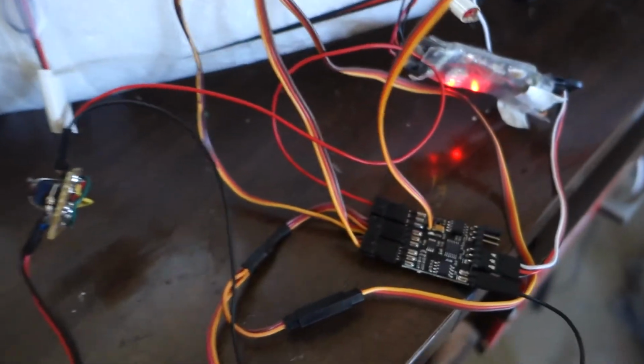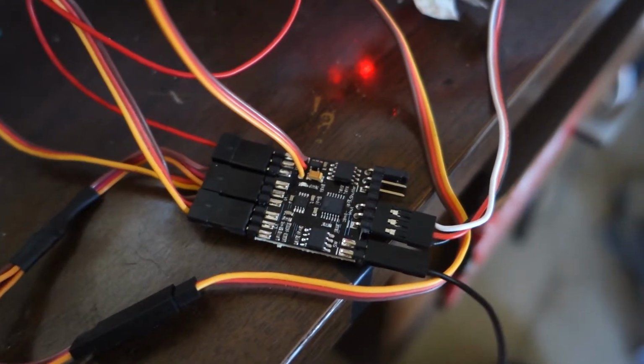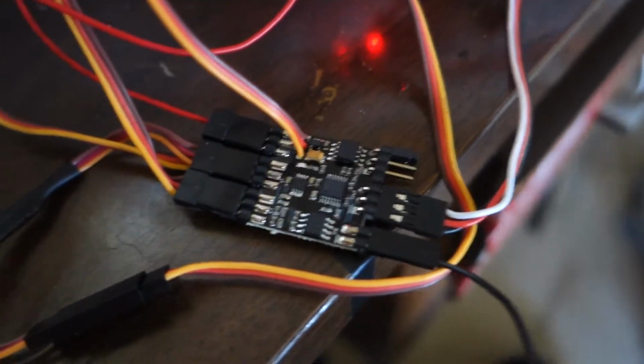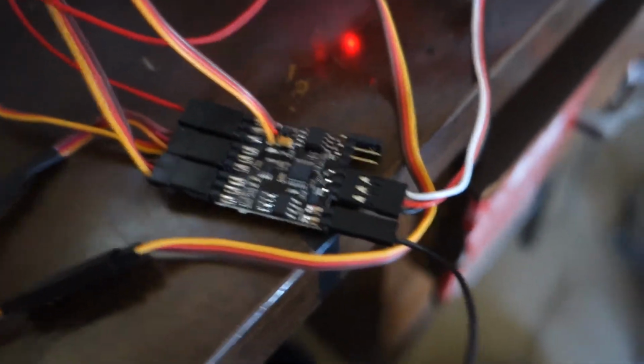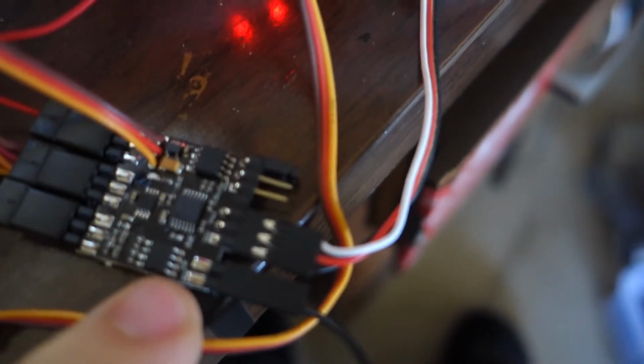Okay, this is a demo of how to use an RCCCv2 board to switch both 5 volt and 12 volt output. The board itself is actually meant to switch LEDs, and it will not switch the plus port, it will switch the minus port on here.